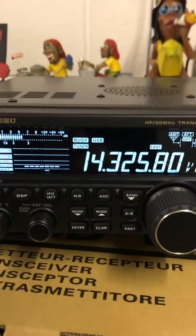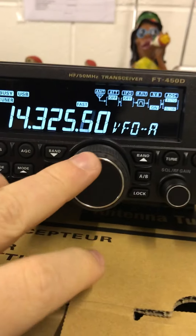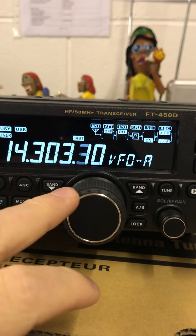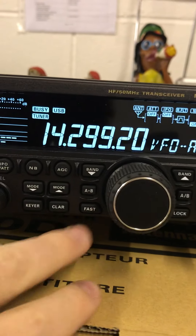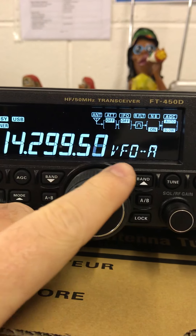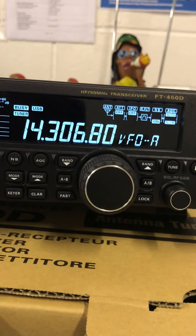Let's take a closer look at what is on screen. Right here we have our SWR meter and our signal meter. As you can see, we are on the 20 metre band. The dial obviously turns your frequency up and down and is currently on the fast scan function, moving in 10 kHz steps. If you want to slow it down there is a button that says fast — press it and it will move in 1 kHz steps. Back on fast, back up to 10.